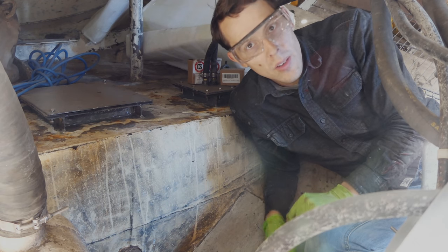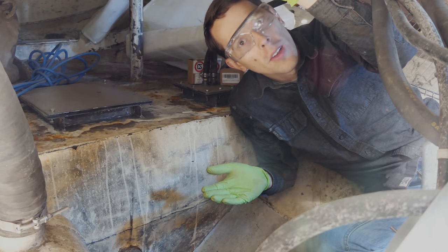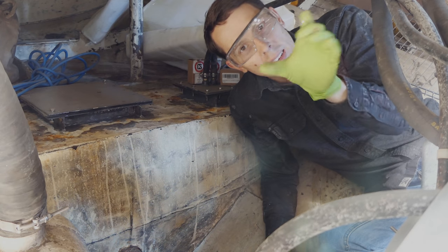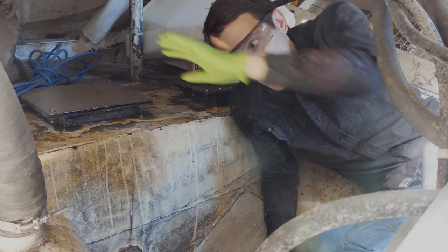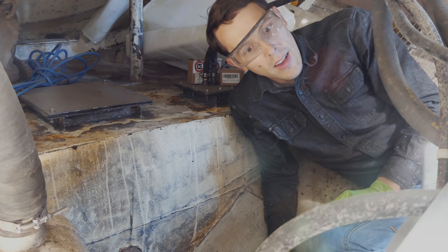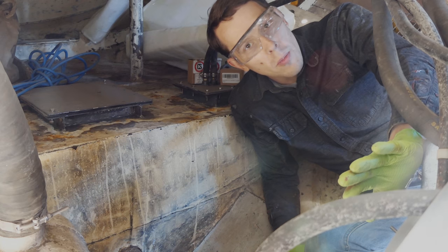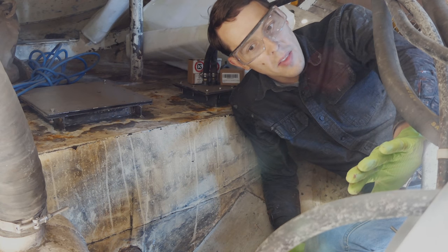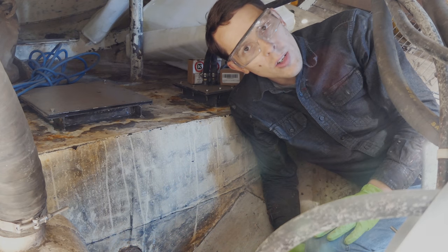So the batteries are about a foot wide and a foot and a half tall, and I don't know, 4 inches wide each, and there are 8 of them. So they fit very nicely right in this space here. And it's far enough away from the engine that they won't get too hot from that. If I'm worried about that, I can put some radiant barrier here, some kind of insulation maybe.